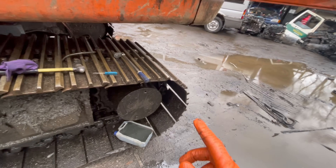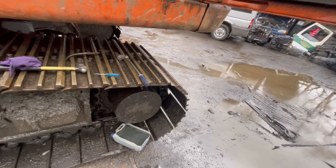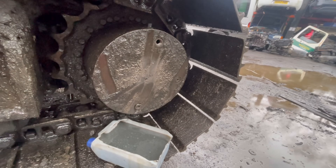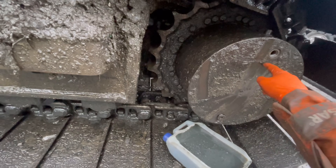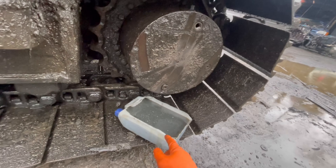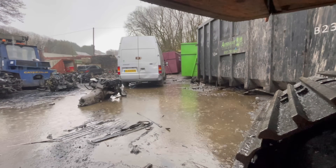This side the oil looks a lot cleaner. However, there's either too much oil in it, or the hydraulic motor is putting hydraulic oil into the gearbox, because it has filled up very, very quickly — it was at least up to here. That gearbox should fill that and no more, so I'm going to have to empty that now. It is miserable out there — proper miserable. I'm hiding underneath the digger, just draining the engine oil. The slew gearbox and final drives take around the same amount — between four and five litres.